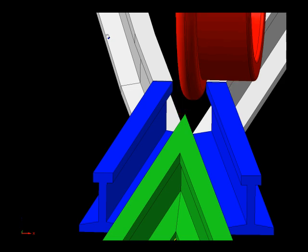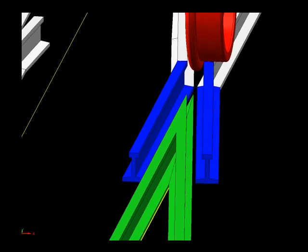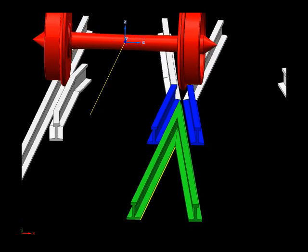Because of this geometry, it ensures that the equipment will roll through the frog without any bumping or dropping into the flangeway. From this, you can see that it's key that the flangeway is as narrow as possible, and the tread of the wheel is as wide as possible to allow that to happen.